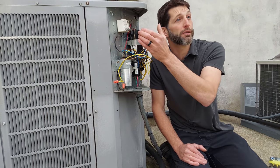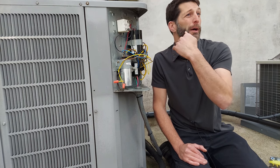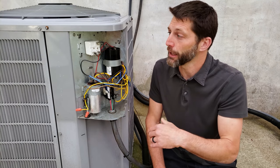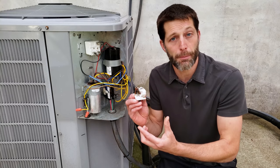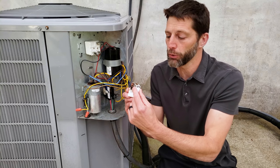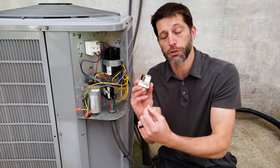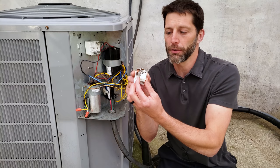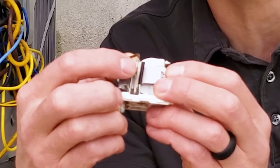You're going to have a potential relay or a thermistor that's going to be opening up the electrical circuit after the first quarter second of run time. It should only be in the electrical circuit until the compressor gets up to about 75 percent of its rotation. At that point the motor is actually going to generate a back EMF — a back voltage — that's going to power the coil of the potential relay and turn it into an electrical magnet, pulling this metal up against there.